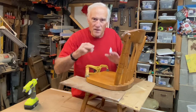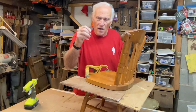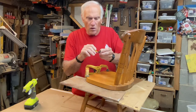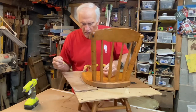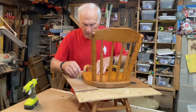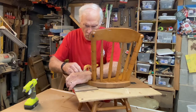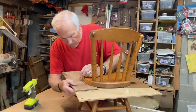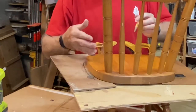It has the shape but it's a little bit small, so in order to accommodate the size I have a fender washer here — it's got about a half inch from the inside of the hole to the outside of the edge. I've hot-glued together some scraps, and what I'll do now is put my pencil in that centerline and let the washer roll against the chair, and that will enlarge it by an inch — half inch on both sides.